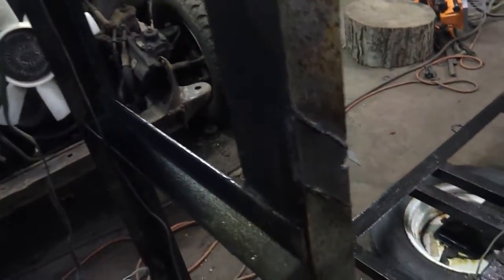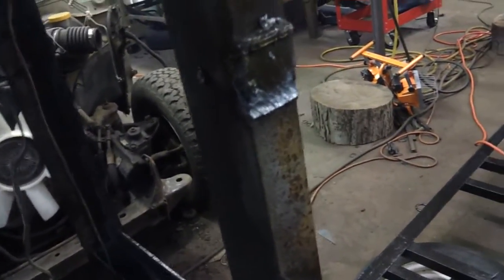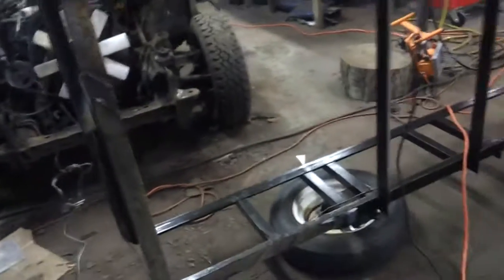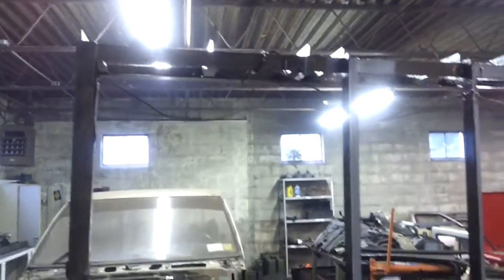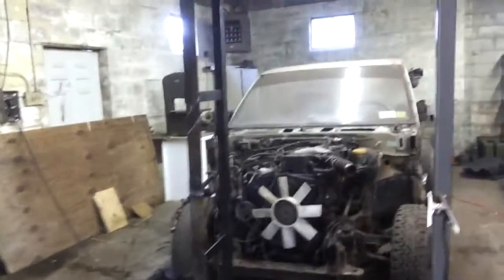As you saw, got the tongue cut off. I've got to do some touch-up and clean up this mess right here — same thing down there. Anywhere there are gouging marks from the plasma cutter, I'm going to come back and grind it smooth so I have a nice clean surface to work from, no cracks or anything in the metal I'm keeping. That's all removed. A little bit of a pain because I was trying to salvage as much of that C-channel as possible since I could use it for something else.